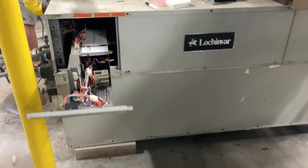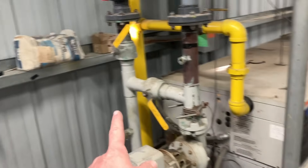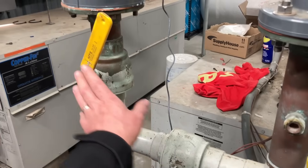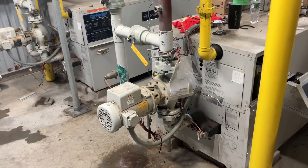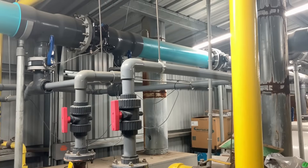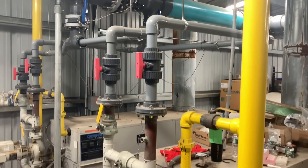We've got these two valves seized into place — these are also seized. But today we're going to focus our attention on cutting out these two valves and replacing them with two full port gate valves. In a minute we're going to fire this up and I'm going to show you how violently this unit is shaking because of cavitation — it's just starting to cavitate a little bit here.